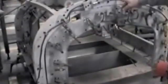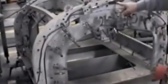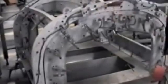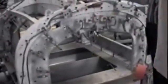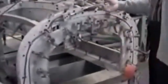What the fixture does, it locates all the parts relative to each other by tooling holes, and applies bond pressure. The cage can be taken off later on or before. We put a hinge on here and it applies bond pressure again, around 15-25 pounds. And you have a canopy in one shot. You can load it in half an hour.